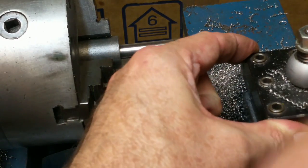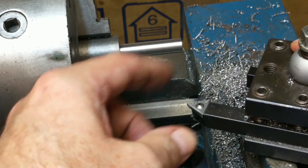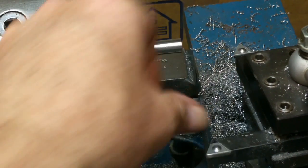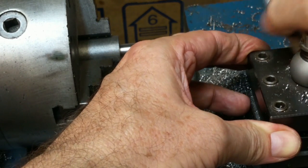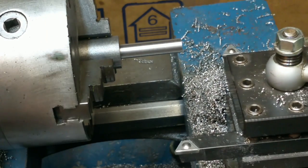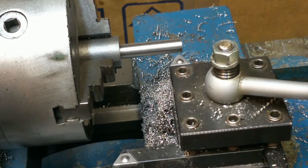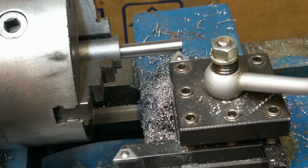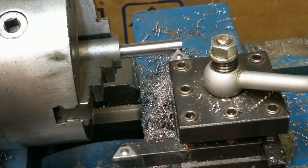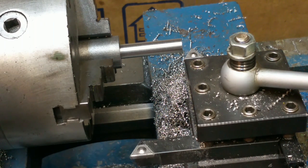okay, I'm going to switch from this carbide insert over to this one. It's a 60-degree included angle, so that's a threading insert. And then I'll come back over here and back it off, zero it out till it just touches, feed it until I can feel it just touch. That's at 10. Back that off to 0, and then we'll take that into 15. Actually, it was more like 15. I'll take it into 20.